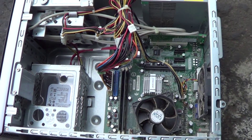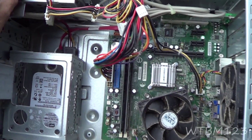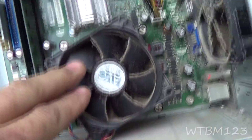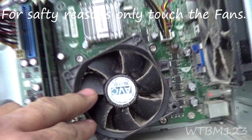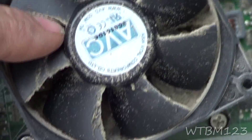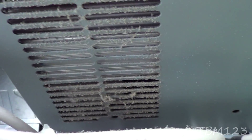I've got a computer in and it's complaining about not running right. Here's some of the first things I see — all this lint. Can you see down there? All the fins are pretty much blocked off with lint behind the fan blades. That will make a computer run hot because it's supposed to have air go across and cool the processor. This external fan is the same way, and you can see the stuff hanging out of the bottom of the power supply.